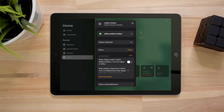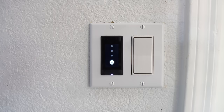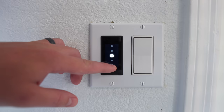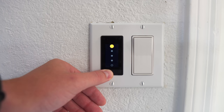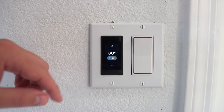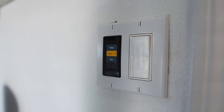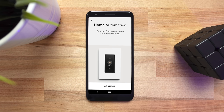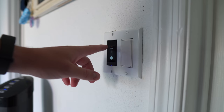Next is a new switch from Oro. What's unique about this is that it has a touch screen and it fits in a regular light switch plate. You can dim the lights with the screen, and there's also a clickable button on top and bottom to turn the light on and off. This worked well and was easy to press even when walking by, but when turned on it does not return to the last brightness level. There's a motion sensor on it that can automate the lights, and a light sensor to adjust the brightness. The lights fade off slowly and on quickly, and this cannot be adjusted. You can connect other devices to the switch — I connected my Ecobee thermostat and Hue lights, and you can also connect it to an August lock and doorbell. If you have another Oro, you could use it as an intercom. It also has an onboard Amazon assistant, however the app crashes when trying to enable it on my phone. This is still very new, so I'm sure they'll be improving it. It can be controlled by SmartThings and you can turn on a SmartThings scene from the switch. The screen was very warm to the touch, and I found the screen a little too small to want to use it all the time, but it's impressive for its small footprint.